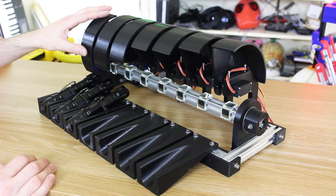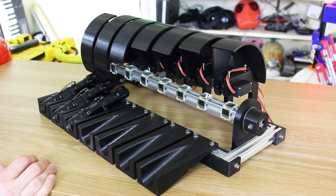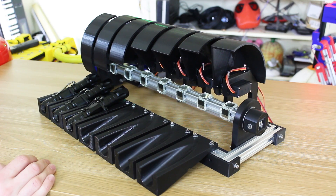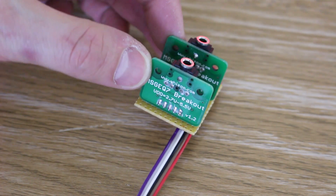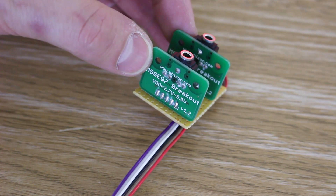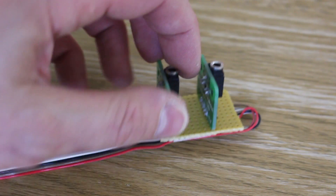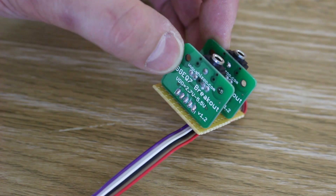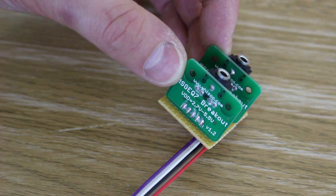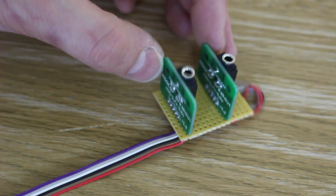The next thing is how we're actually going to strip out the frequency bands to control the servos. If you know why I've used seven bands, you'll know what I'm going to use — yes, it's the MSGEQ7 7-band graphic equaliser chip, which is very useful for making 7-band graphic equalisers. I've got a pair here soldered on a bit of breadboard, which I've used in other projects, including Ultron's ears. These ones are from wizoo.com, and you can also get the Arduino library which supports a stereo pair.